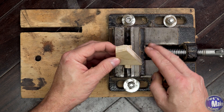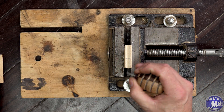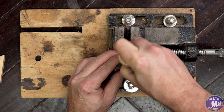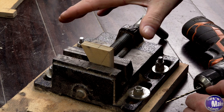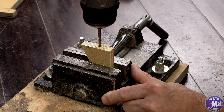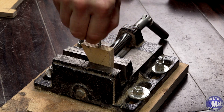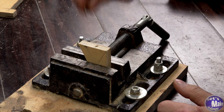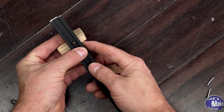Now the nice thing about plywood is that it's always oddly stacked. This piece has 11 different layers in it, so what I can do to find the exact center is just count in 6 — and this one here is going to be my center. If you've ever worked with plywood, you know that drilling into the edge is the worst way to attach something. But in this situation I'm kind of stuck, so I'm going to use a little bit of a wider bit where the threading of the screw just barely reaches over. You can see I can even twist this in myself. I might add epoxy later on if I need to, but it really needs to be a lot looser because otherwise it'll just spread it apart as you try to screw it in. With both holes drilled out, I can add my track — a regular standard track should work fine for this.